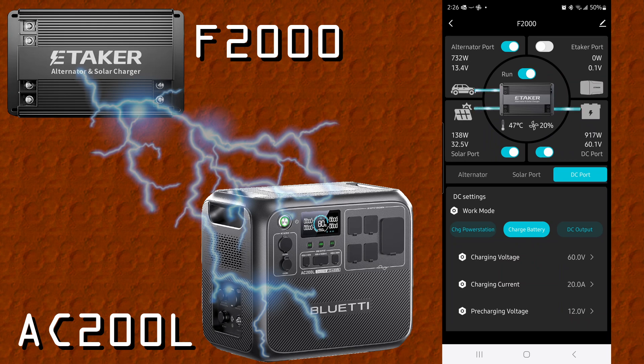Now that I've shown you that you can charge almost any kind of power station, please read your manual and check the maximum voltage, then do the appropriate configuration on the app — because you might break your power station or the F2000 if you're not careful. Make sure you're doing the right polarities too. Even though the eTaker has reverse polarity protection, still be careful and do it right. Check my other videos — I did a jump start test, since this unit can also jump start a car. See you guys later. Bye!